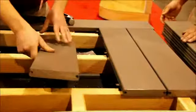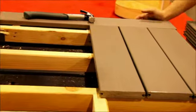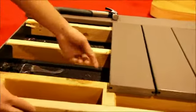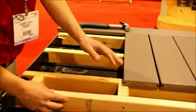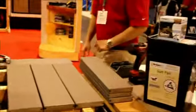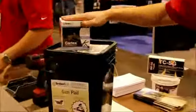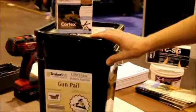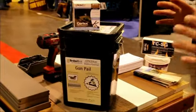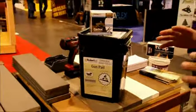You come back, you throw your next board on, and then of course once you get to the last board, the last board probably you don't want to have a groove on it — you're going to have a square edge board. In that time frame, you come back with your Cortex. So really your Cortex system and your clip systems are really going to complete a complete hidden fastening system. Never again do you have to see face fasteners on a hidden fastened deck.